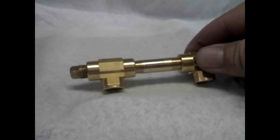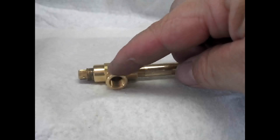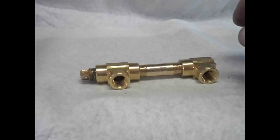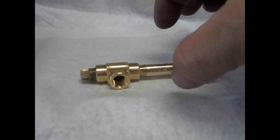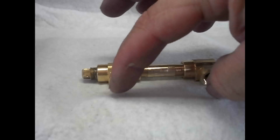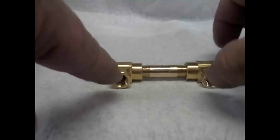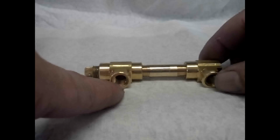So that's pretty much it. One thing I will mention is that you want to have a valve on your oil supply. I like to have it close to where it enters the burner, so that I can adjust it easily there. Let's see, and then this tube gets mounted inside a blower tube. I just drill 2 holes in the side where these fittings are going to go, and use another nipple fitting to go through the pipe, and try to mount it as close to the middle of the pipe as you can, the pipe that you use for the blower inlet, the burner tube, I guess I should say.